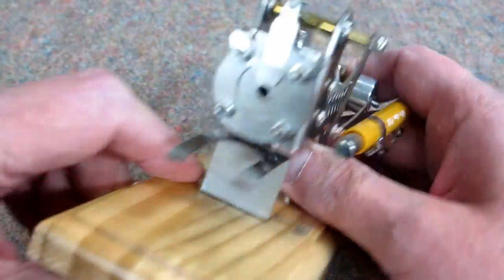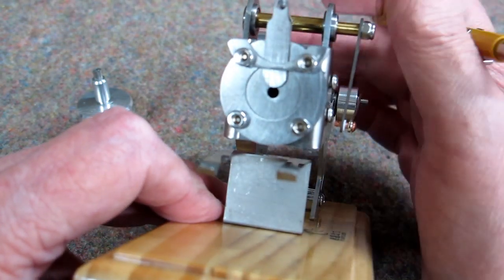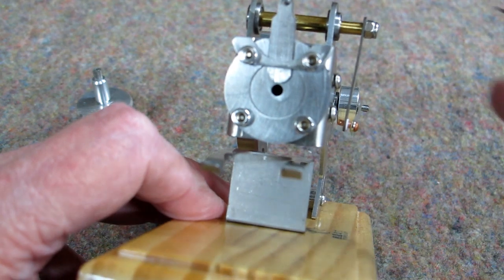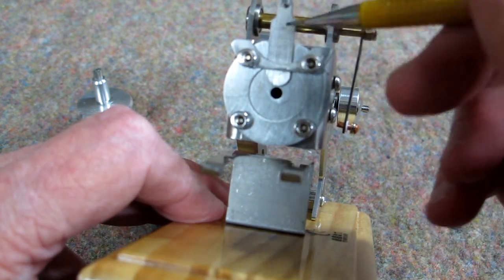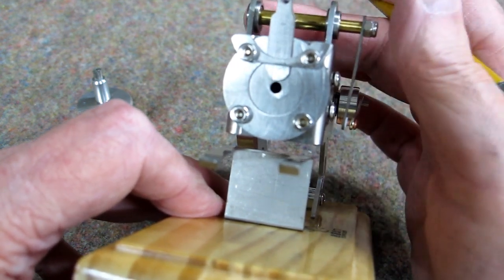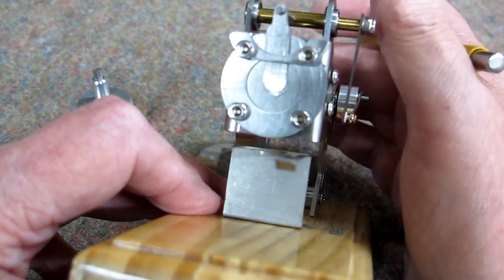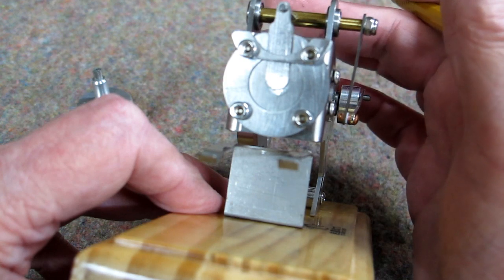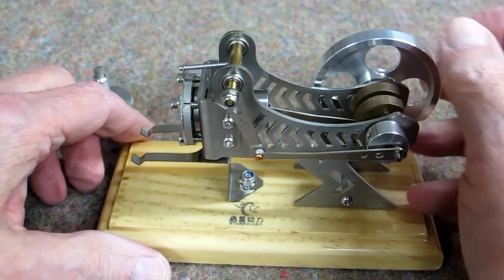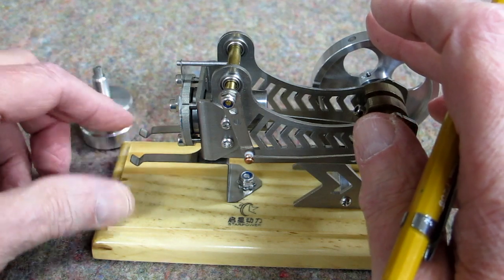This is the alcohol burner. On this engine, it has a piece of stainless steel that goes up and down as the valve over this intake/exhaust port. This is a rigid piece of material — not a piece of thin shim stock like what was on the other vacuum engines. When this is adjusted properly, it should completely cover that hole. It just covers the hole; it travels a little further.